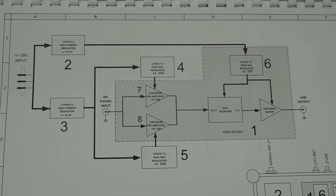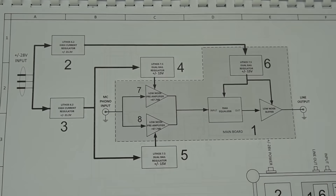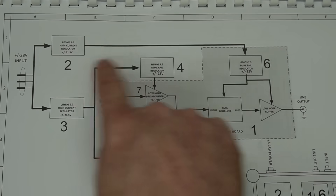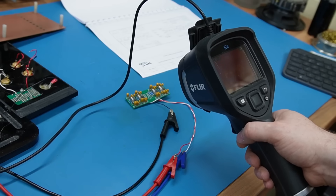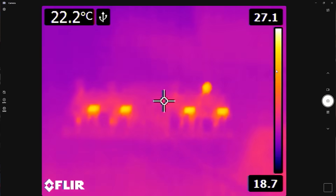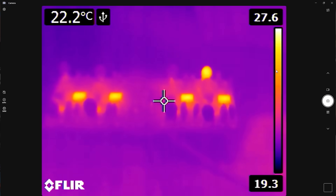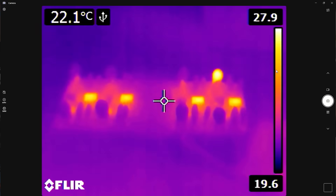The large amount of circuit boards here — if we look at that little diagram that Mark drew up — shows that there's quite a lot of redundancy in terms of power supply. But all those boards are quite densely packed, and I'm pretty sure those densely packed boards heat up, and you can see here that there is a problematic tantalum capacitor.